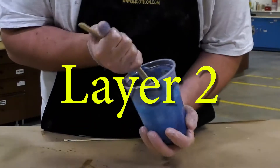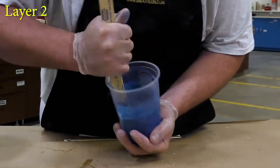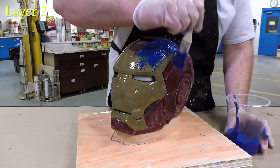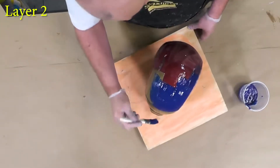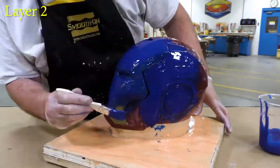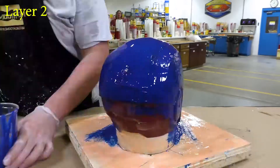In the second layer we're going to dispense the material again, but this time we're pigmenting it with some Silk Pig blue. This is going to help us distinguish the different layers that we're applying and assure thorough coverage of the entire piece, then we can simply go ahead and apply that silicone to the entire mold surface. The material is now allowed a partial cure for 60 minutes before moving on to the next step.